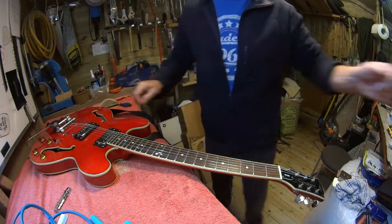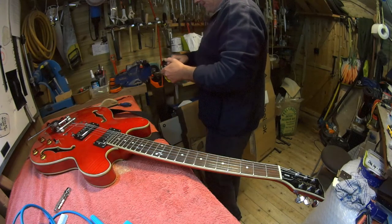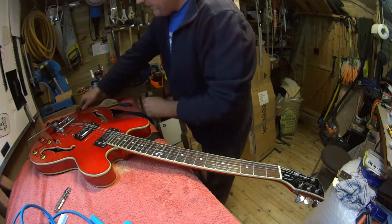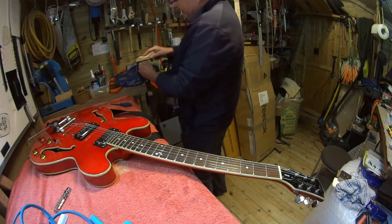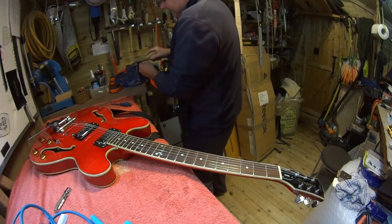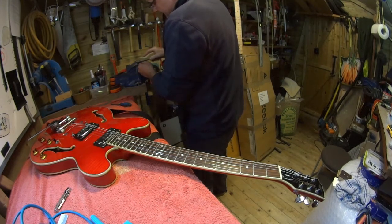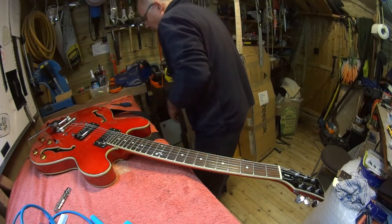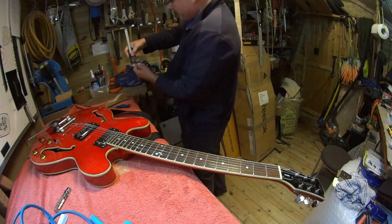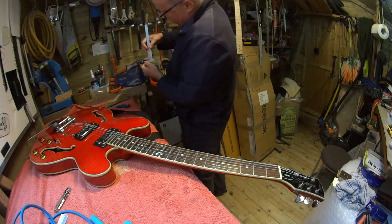What I'll do is I'll just take a measurement at the end, just so I know where I've taken. I'm going to take a millimetre off to give me that room to play with. I'll just take the edge measurement for now. Edge measurement is 9 mils, or 8.82, so I'm going to come in at 8 mils exactly. It's just a matter of going by eye to keep this cutting the same amount all the way across. I'm measuring it regularly just to see where we go. 8.9 there. We want just 8, don't we? We come in at 8.